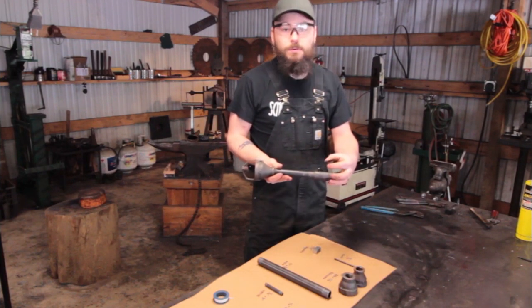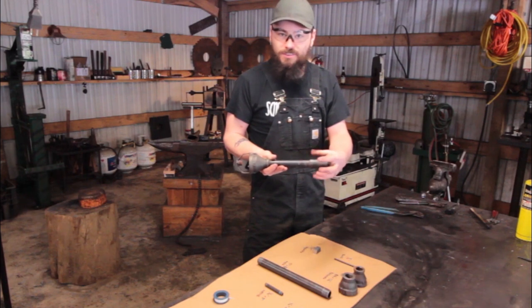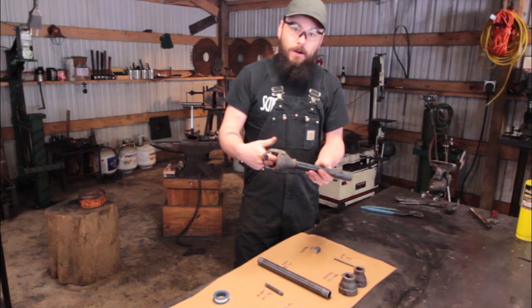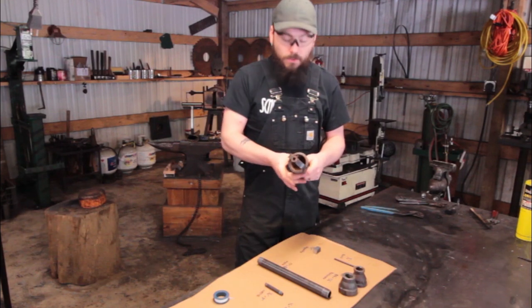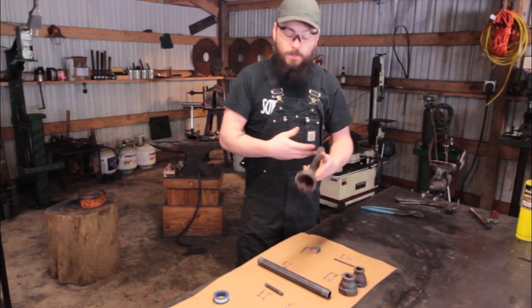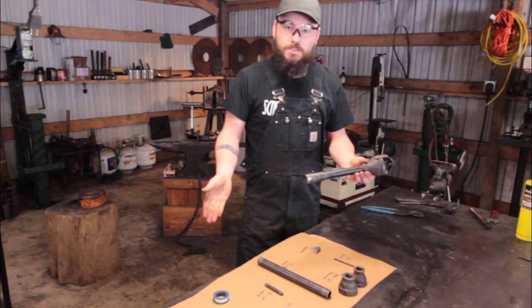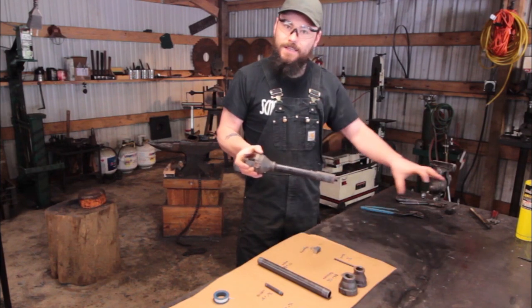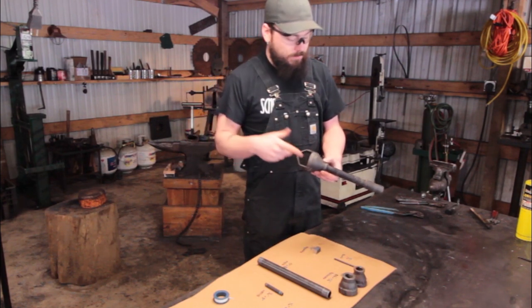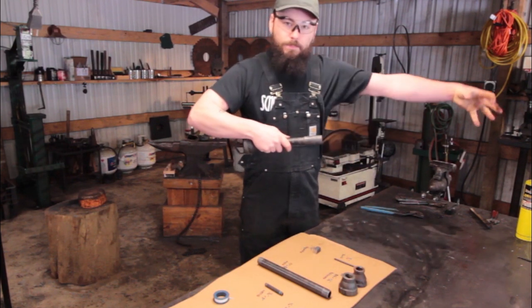Basically, when your torch is working, all your fuel and air are captured up in the cone. There's a little expansion pocket right there because it's bigger than the body. When these gases ignite they expand, causing a vacuum that sucks air and gas in through the funnel — creating a jet stream and increasing velocity through the tube, because it takes a large volume of air from outside and shrinks it down into this small tube, then spits it out the other side. That's what gives it that jet effect. Basically, propane shoots down the middle, mixes in the tube, catches fire, expands, and throws out the other end.